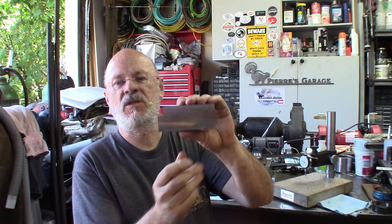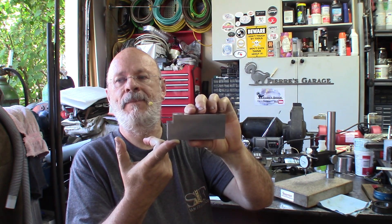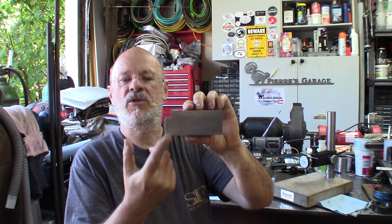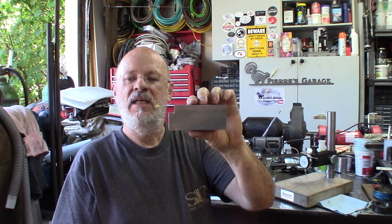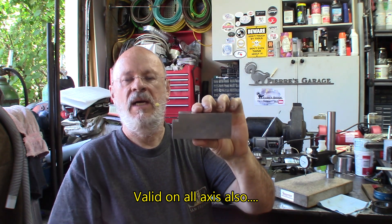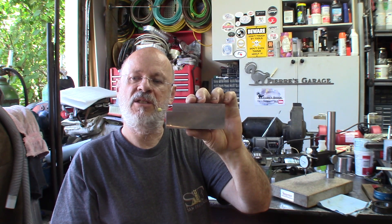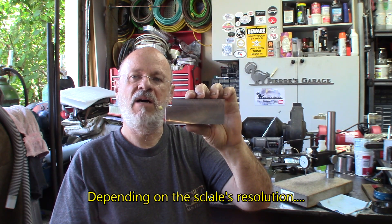If you have a chance, go see Harold's channel. Now concerning the main part of the video today, we're going to be demonstrating how accurate a DRO on the milling machine can be. I got this block here and sometimes we need to measure some heights or steps pretty accurately, and we don't really want to dismount the part or we're not always in a position to insert micrometers or any measuring instruments on the machine. We'll be measuring this corner there using the DRO and indicator, and compare that to a few other methods of measurement to see how accurate and consistent the measurement can be.